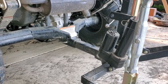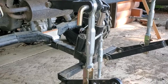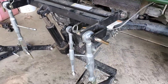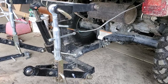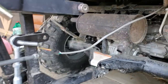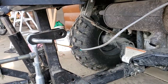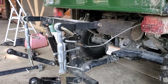You can see right there I removed my ball hitch and put this 3-point system in. It has down pressure through this electric cylinder here. There are a lot of implements on the market for ATVs and side-by-sides, and if you read the reviews, they'll say they can bend your hitch down there on the frame. So there is a support that goes with the implement — I had a bracket welded on right above the muffler — and that's going to connect from there to the 3-point hitch. That's how it goes on; it's attached in two places, essentially, once you put the support bracket on.